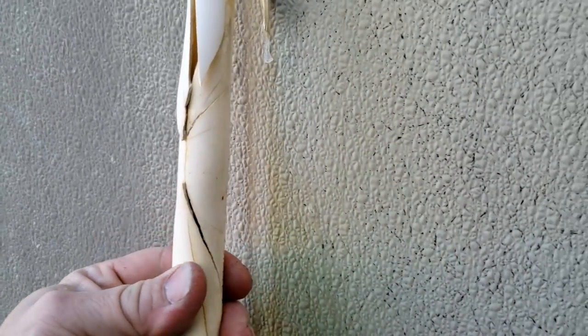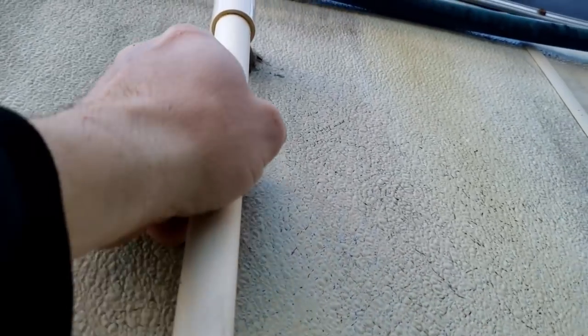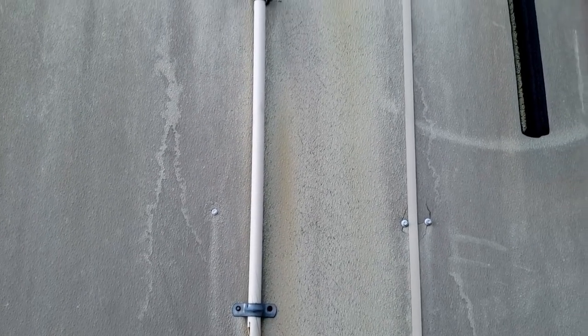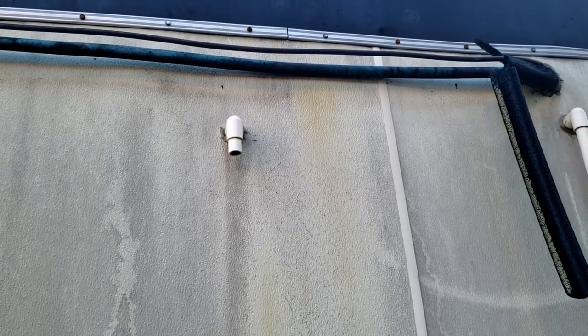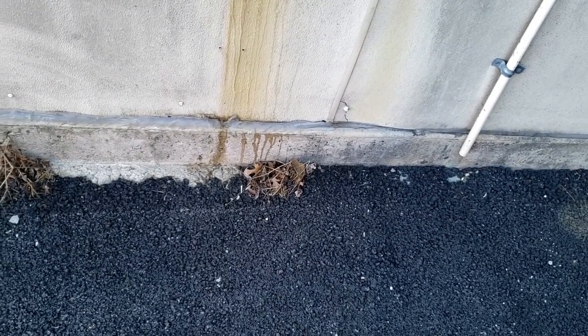Pretty sure that should be the very last one, so it should be this one right here, which is all busted to hell. I have a feeling that the drain isn't working for anything and it's probably freezing up out here on the end. I'm gonna go back in there and see if we can get that to come on through the wall. I bet anything we cut that at the top — that's probably where the issue's at. Plus I don't think it has a trap on the inside. We just tried blowing it out and it went right through, no problem.